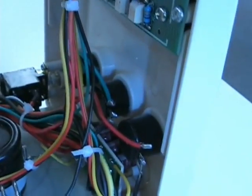Looking inside here, this output board has filter caps directly on the output board — they look like low ESR ones, or high temperature, high performance ones, so that's not too bad at all. Down under the bottom there's output diode protection, and it looks like it's got a big beefy diode, so that's all nice and good. The actual wiring construction has nice proper spring washers and everything, so that's done quite well.